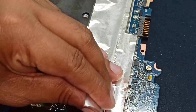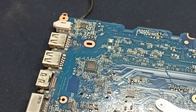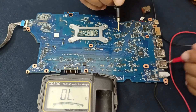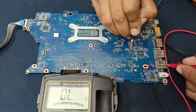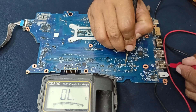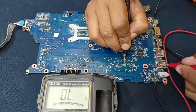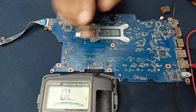Let's check for the short circuit — here is an easy way to find it. I am checking some capacitors randomly. I hold the positive lead in the ground position and the negative lead in my right hand and I am checking each capacitor. When I attach this capacitor in ground position it shows short, and when I attach the negative pin in the positive condition it shows no short — that means this capacitor is okay, absolutely fine.